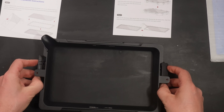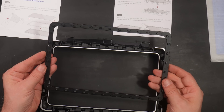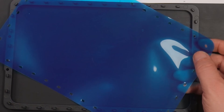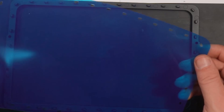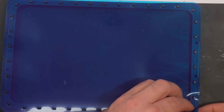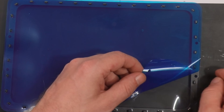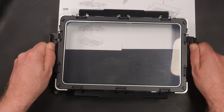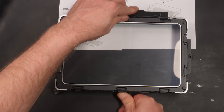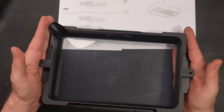There are four levers, one on each side, where you can loosen and tighten the clamps that hold the inner frame. The set also came with three pieces of PFA film. It's very easy — remove the protective film on one side, install it on the small tabs that match up with the holes, then remove the protective film on the other side. Put it back into the tank, tighten the clamps, and that's it. That was pretty easy — now it's ready to go.